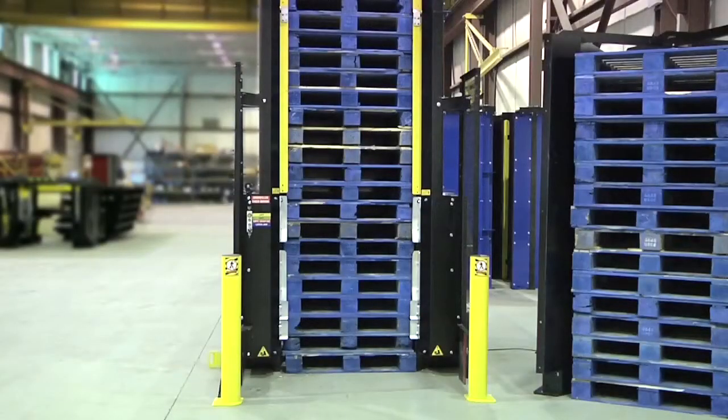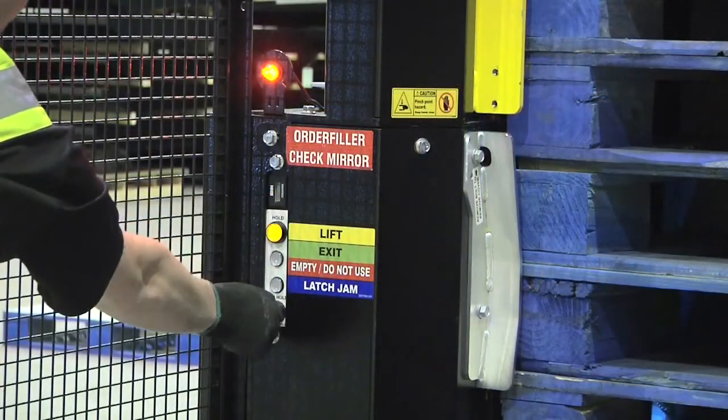Or, if your machine has a power supply, it may not be plugged in. Confirm the front yellow light comes on when the key switch is turned to hold. If it doesn't come on, check to see the power supply is plugged in and the LED light is on.